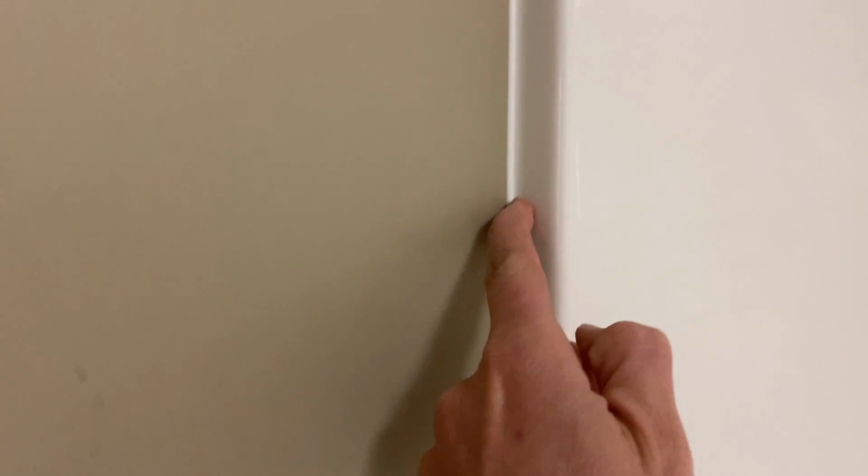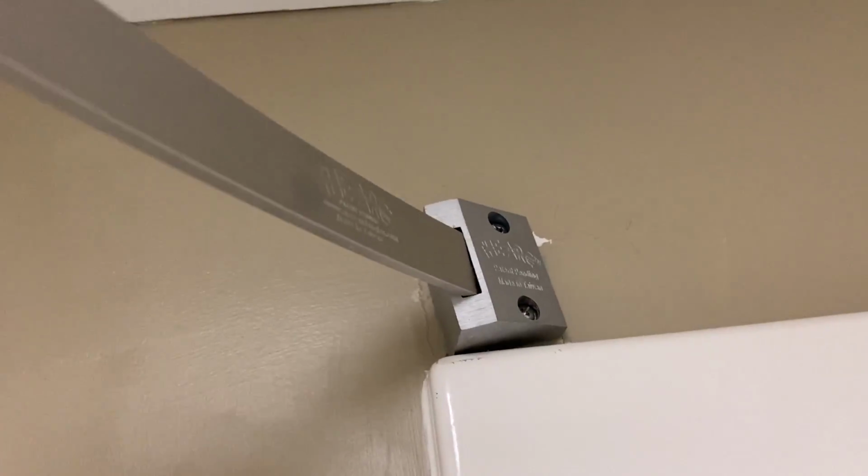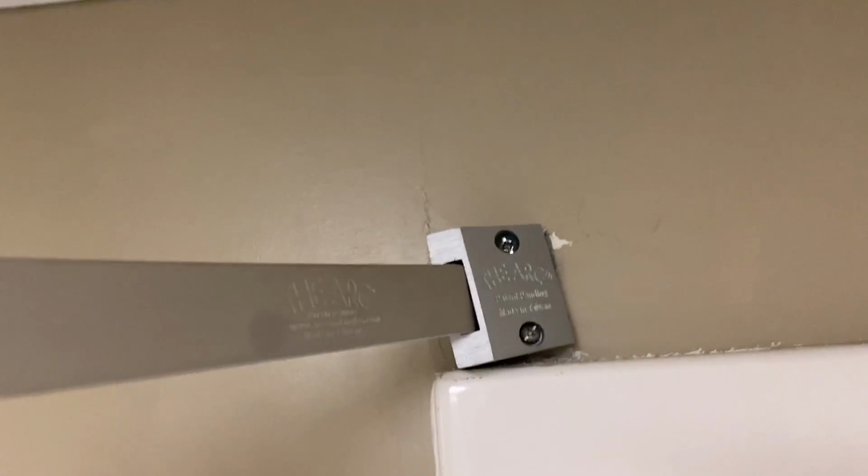And moving up from here, if we take a good close look, it's really not looking too bad. It's been caulked and painted. Got a little cracked joint up there. This could be refastened with some better screws. There probably isn't very good backing behind it. In fact, I'm guessing those are toggle bolts, and clearly there's been some work done on it.